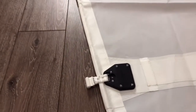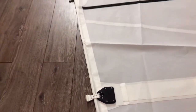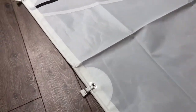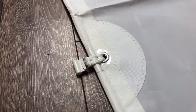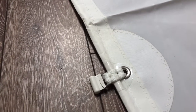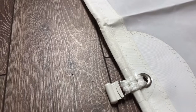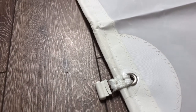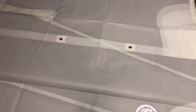We'll just stop here at one of the full battens — this is the top one. We have these Bainbridge batten receptacles that are bolted through the sail, and the batten is going to slide into that so you've got something to push against, giving really nice tension on those sails, especially in light winds. Just stopping at one of the sliders here — notice the reinforcements with the Dacron, and then you've got grommets going through. There's a piece of clear vinyl that goes around there and stops any chafing. The webbing goes through the grommet with what we call a figure-eight stitch, and that makes sure the slider doesn't change position. When that slider starts moving around is when you start to get problems with jamming.